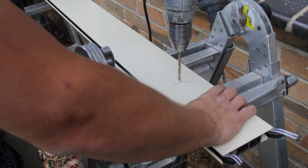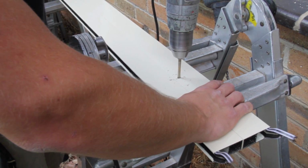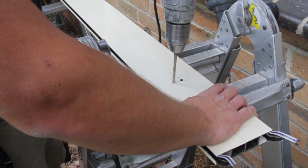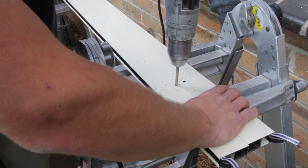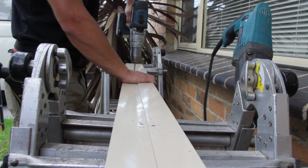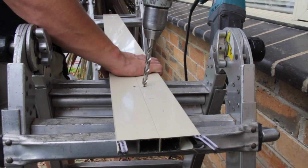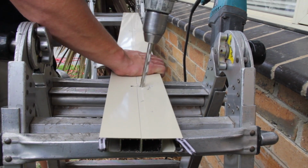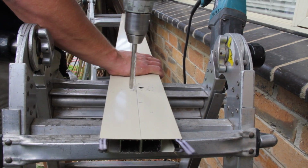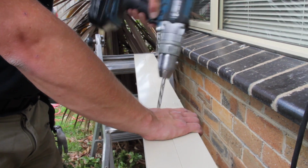Use a 5 and 9.5mm drill bit for preparing the tracks. With the 5mm bit, drill through the track completely at your marked locations within the square hollow section of the tracks. Make sure they are all done evenly, and then to complete the process, drill a larger hole with the 9.5mm drill bit, making sure that you do not go right the way through the track. This allows a plug to be put in later and cover up your holes.